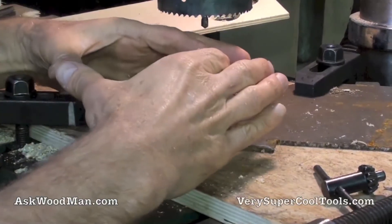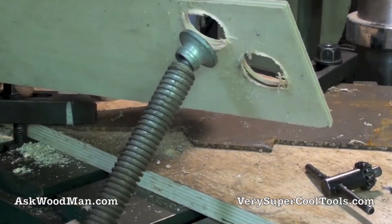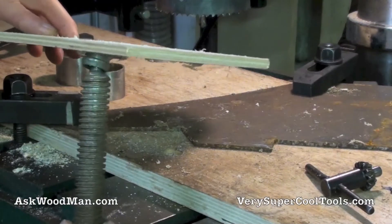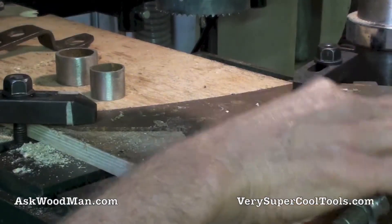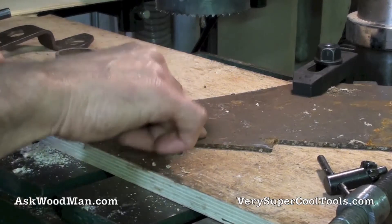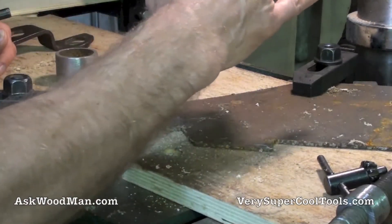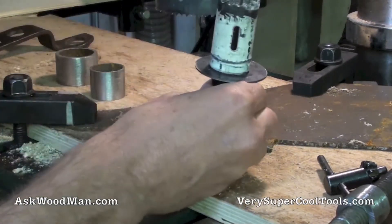I'm making a disk that's going to have a hole in it this size. This is where my threaded screw — this piece off this old clamp — is going to fit up in here and not be able to wallow; it'll just sit and rest in here. I'm making this out of what looks like 10-gauge stock — it's a little chunky — but I've got the scrap here. I'm going to use this big hole saw and cut a circle with a specific size on the inside.